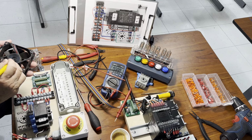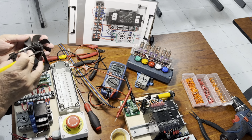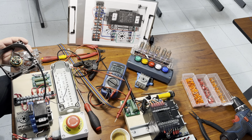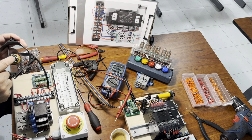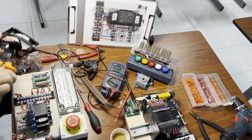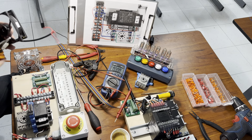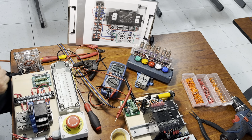And we also remove the propeller. It comes out. The magnet is all around the propeller here inside, okay? And now we want to watch. These are the windings of the two phases for the brushless fan, okay? However, because you can't see this right, I'm going to cut the plastic supports, okay, so then you'll be able to see it properly, like that. So we remove it from here, we leave it aside, okay?